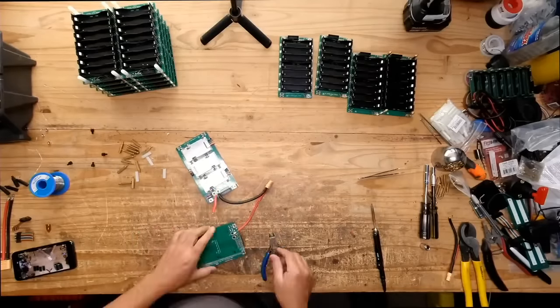By the way, I think that battery on the EcoFlo would last quite a bit. I tested it, because by having access to the actual battery terminals, I could measure it. They charge all the way to 4.1 volts, and then when it completely stopped working it was at 3.3 volts. So they're very conservative with the battery cycle. That means the battery is gonna last a long time, many, many cycles, because they're not totally killing it.